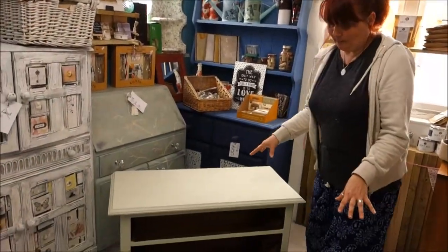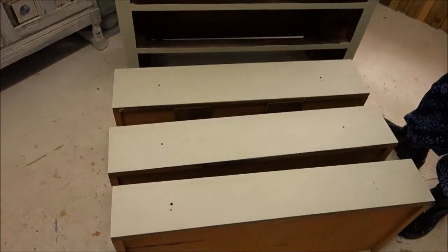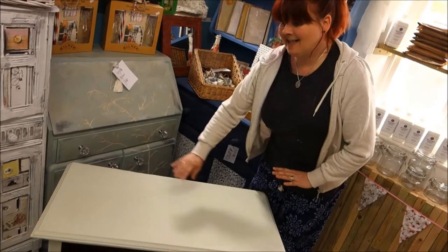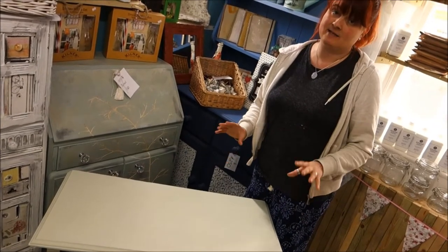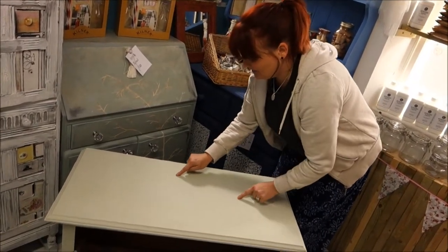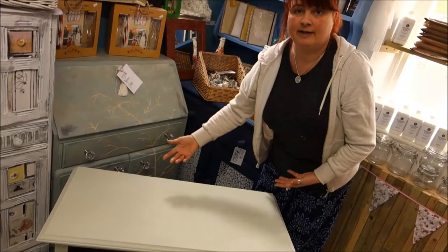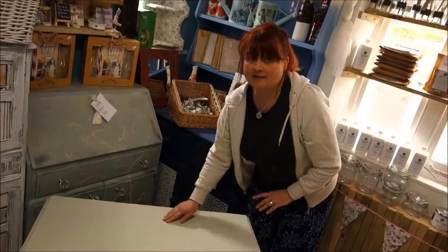Right, as you can see it's looking a lot better - she shall go to the ball! It's taken some time, patience and determination. Just to run through a couple of pointers for future reference: this has literally had three, in some cases four, layers of finishing coat to get rid of that very heavy staining - that's about as bad as it gets. We've got a couple of spots here with just a little bit of staining left, so I'll put a tiny bit of finishing coat just on those problem areas. You can gradually touch up just the areas that need doing.